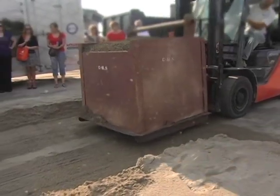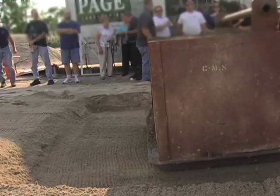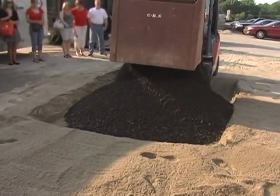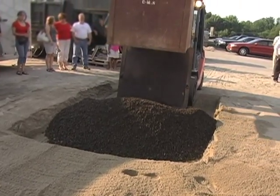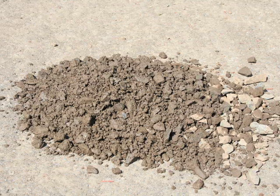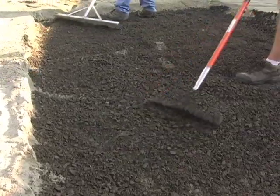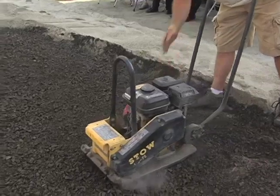We're really close to starting to lay those pavers, but before we start, we need a good solid base. A good base material is important because it will help prevent frost heaves and plants growing into your patio. The pros at Chicopee Mason Supplies can advise you on the right base material and supply it directly to your worksite. We like a coarse gravel because it will drain properly. Begin placing gravel and compact it with a gas-powered plate compactor. You can also use a hand tamper.